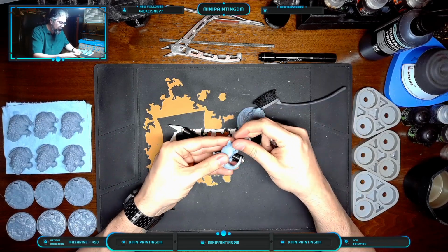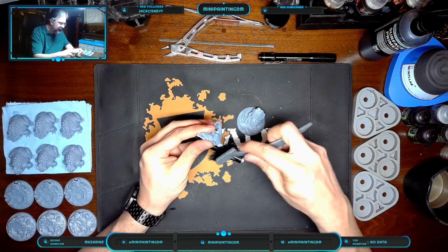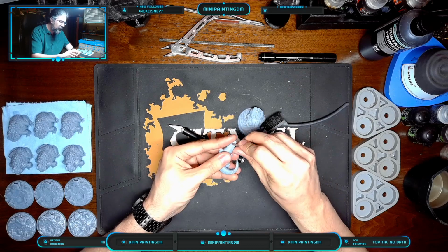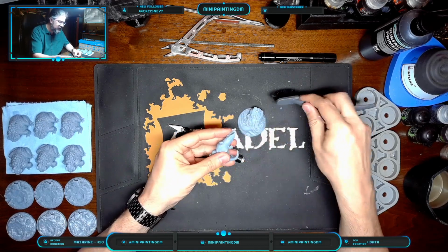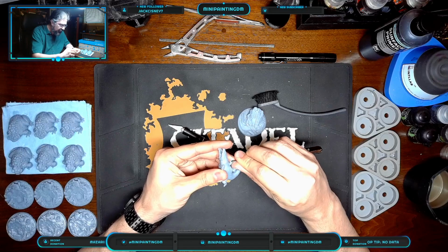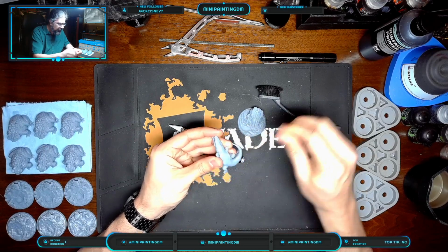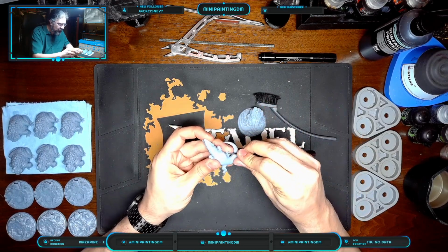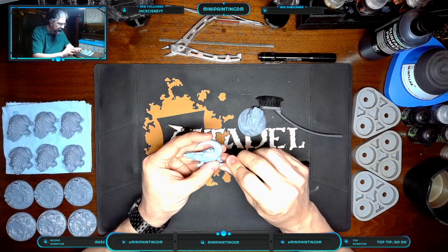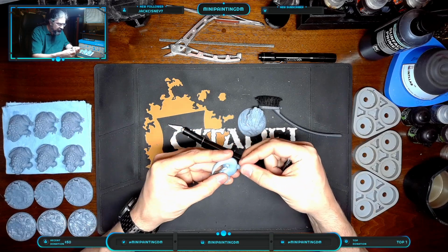I do have one last print on the printer. There's a problem with the actual print file. It's funny, it succeeded on the first 2/3 of the model, the bottom half and the top 1/3, but there's a good section of it that's just missing. I'm pretty sure that was a problem with the slicing. I was screwing around in a game at the time. I think I alt-tabbed in mid-slice. I don't think I'm going to try to play games while slicing anymore, or alt-tab away from the slicing software mid-slice. I think essentially the renderer got interrupted and it just sort of skipped over a whole section in the slicing file.